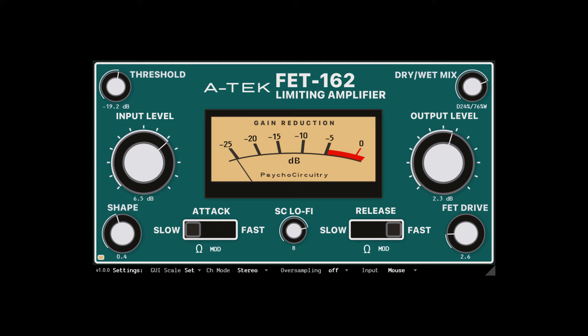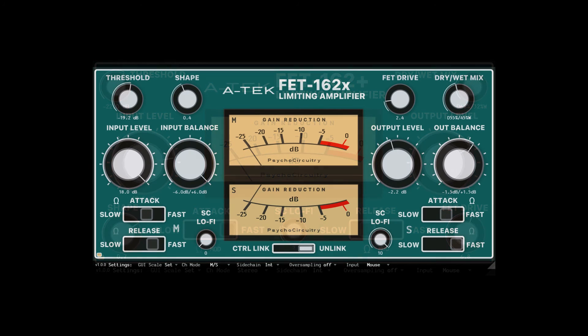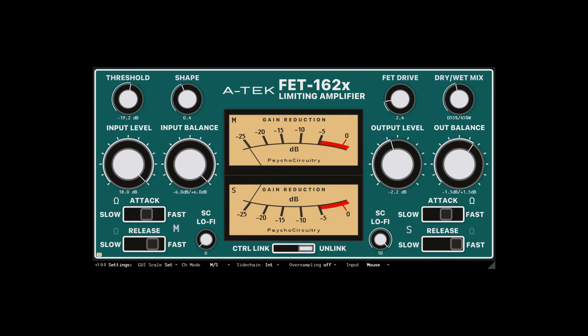I'll cover more of the design-specific differences a little later. While the compression behavior might be softer, it's still a mid-'60s unit with plenty of harmonic excitement on tap. The original unit is pretty simple both in design and operation — like a lot of gear from this era, its strength was in all the functions it provided in one package, designed as a microphone preamplifier with additional line-level signal summing capabilities and a handy safety limiter with slow/fast settings intended as music and speech timings respectively.